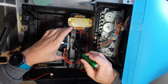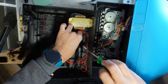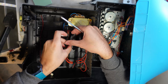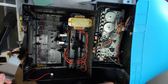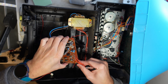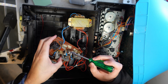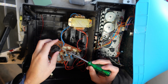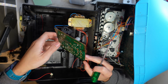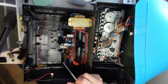Let's take this power supply board apart. We need to take this screw out on this metal bracket, then the two screws on the figure-of-eight connector. Metal bracket is out — careful not to break anything. This is the battery in. As you can see, we have a little bit of corrosion down here, and by this cap, this has the aspects of already having had some past work on it. This glue really gives some trouble on some products. Let's check some capacitors.